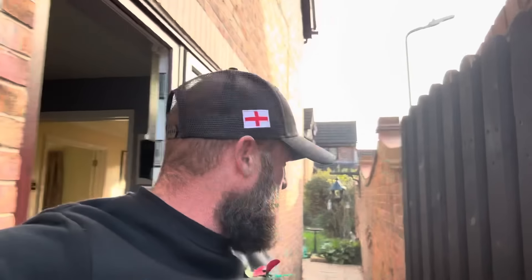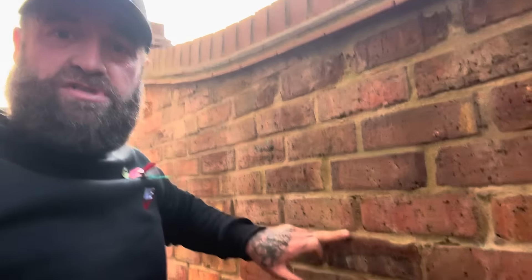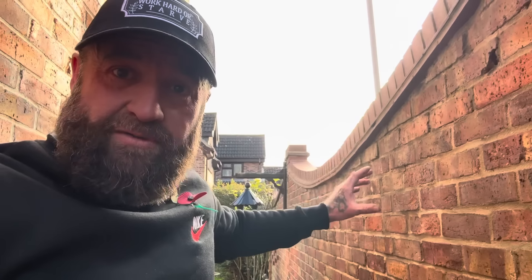Being the wall as a whole — look, it's a big wall. What's happened is traffic driving by on the road; as soon as it hits, it vibrates the perps, and we push and push and the weight is spread through the perps, right down the wall. So if we investigate here — minimal damage. I'm predicting minimal damage throughout the wall, but the more damage will be at the end on the corner, because that's the next weak point. Let's have a look.